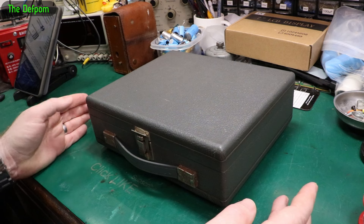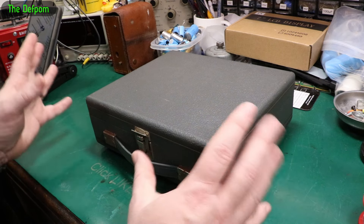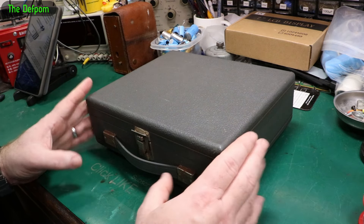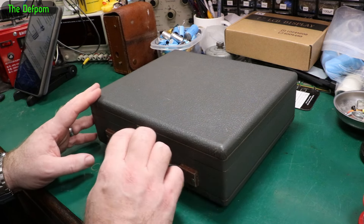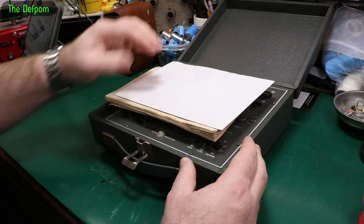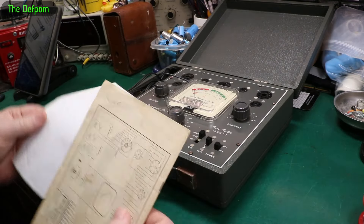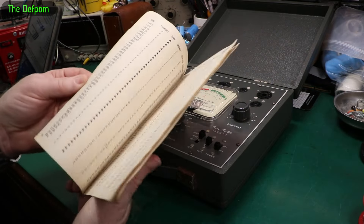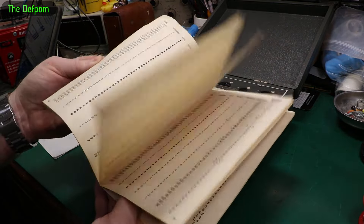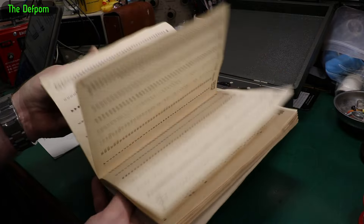You never know if you've got wiring which is disintegrating because it's made out of rubber. You just don't know, so you need to check these things before you plug them in. This is 110 volts, not 240 volts for me, so that's potentially problematic. I was lucky enough that it came with its original manual, circuit diagram, and setups for the tubes, which is brilliant.